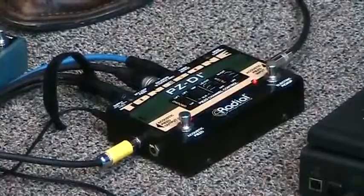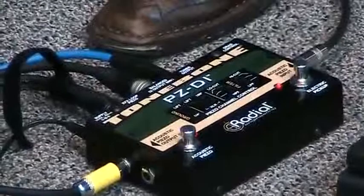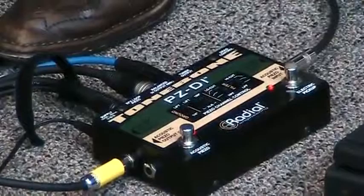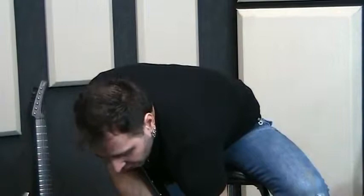When you are hooking up two different amplifiers sometimes, you're going to get something like this — that horrible buzz. Can you imagine dealing with your sound like that? You don't want that. So we have something called the ground lift. Basically, that just lifts the ground so you can plug in two different amps at the same time and eliminate that problem.